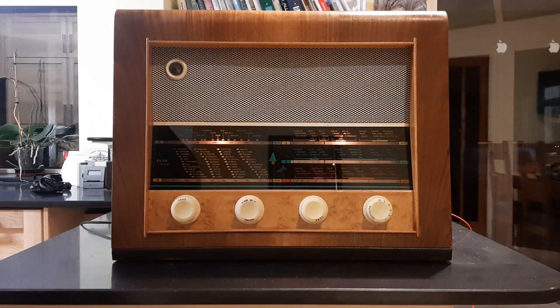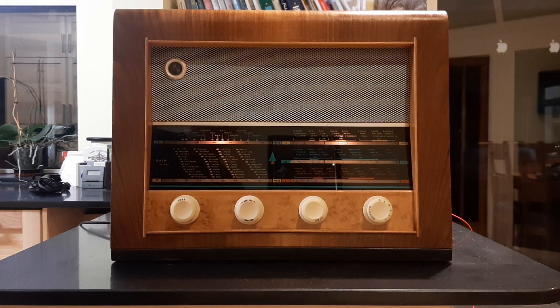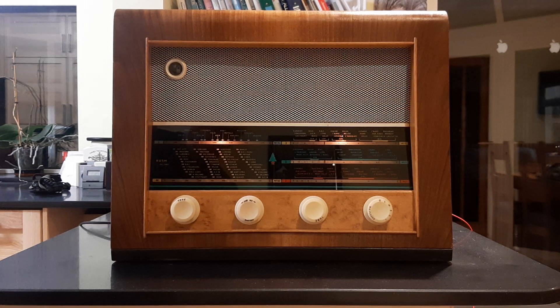Pretty good. Now, some purists would say that what I've done with this radio is a bit of an abomination. But I really had no choice — I was never going to get a valve to sort out the audio output problem. Even if I had got one, there was no guarantee it was going to work or last very long because of the age of this type of component. However, it is working, albeit through a transistorised output stage, and the Bluetooth module will make it even more useful for the owner, who I hope will be happy with the result. So if you have been, thanks for watching.